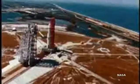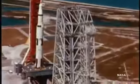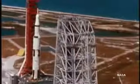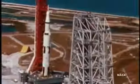To keep the rocket perfectly level on its trip down the crawlerway, NASA developed an ingenious sensing solution. A pair of pipes filled with mercury ran diagonally from corner to corner under the platform, bending up at the ends with a wire inserted into the tubes, a hair's width above the mercury. If the platform tilted, the wire's contact with the mercury would short it out, sending a signal for hydraulic fluid to lift the appropriate corner to level out the platform. The system worked so well the launch escape tower at the very top of the Saturn V never moved more than five inches away from perfect vertical.